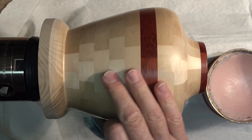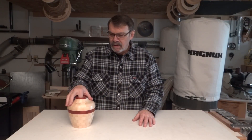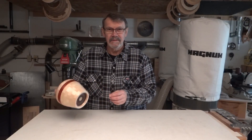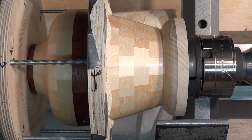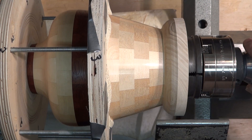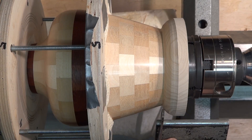That looks and feels real nice. Now to answer the question Lucas posed — let me show how I revealed more of this disc. I've got it reverse chucked into my doughnut chuck; the tailstock end is in my live center using a cone to keep it balanced. I'm going to use my parting tool to part it most of the way through and then finish it with a saw, turning at 750 RPM.